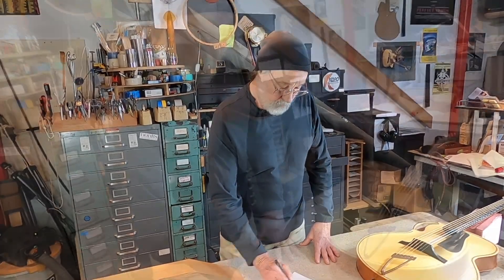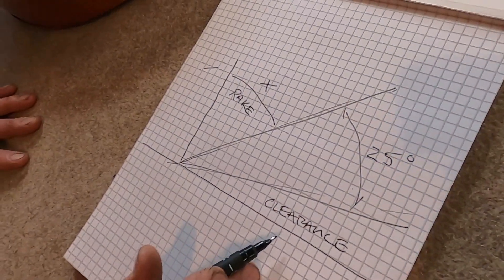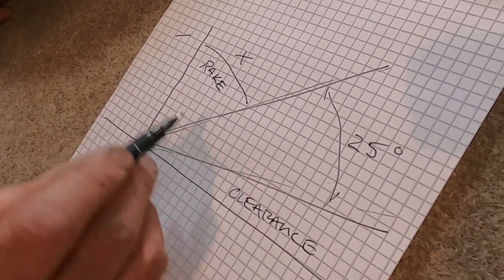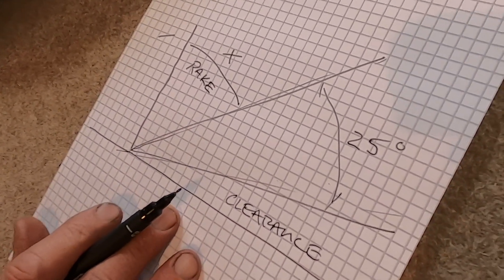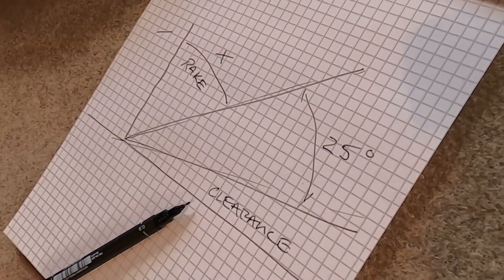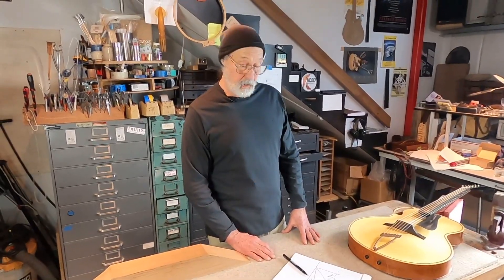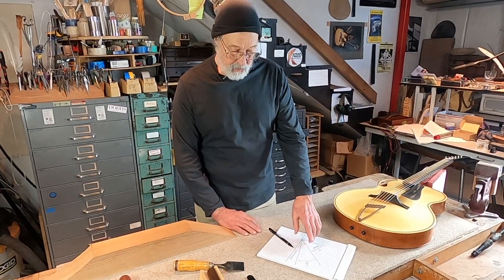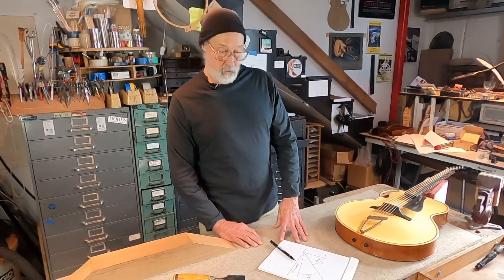So normally with these considerations, we can describe pretty much any tool in any kind of woodworking cut. These clearance, rake, and sharpness angles are going to be part of what we're looking at when examining any kind of tool, whether it is a saw, a twist drill, a router bit, a scraper, chisel, plane, spokeshave, or any kind of edge cutting tool. We're going to try to understand and optimize these geometries for whatever cut we're trying to make.